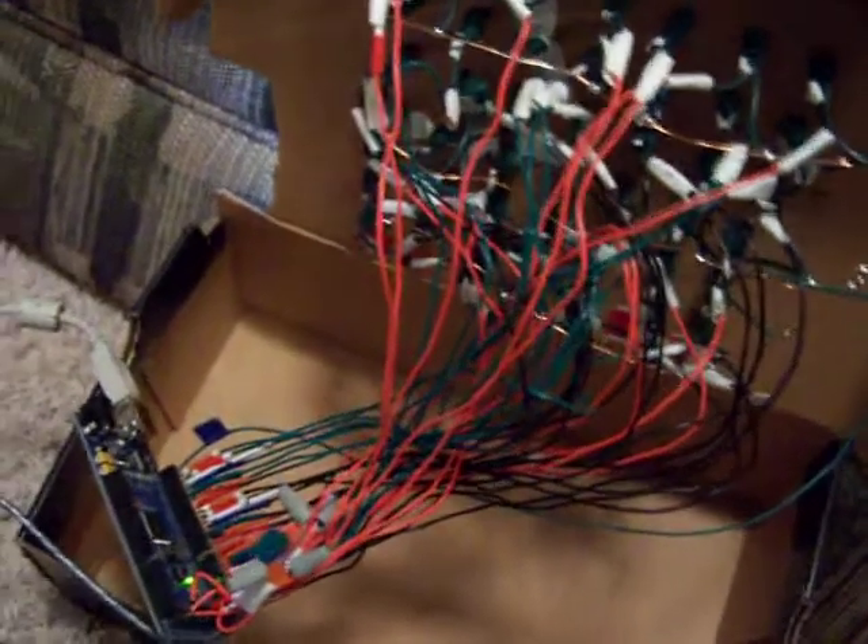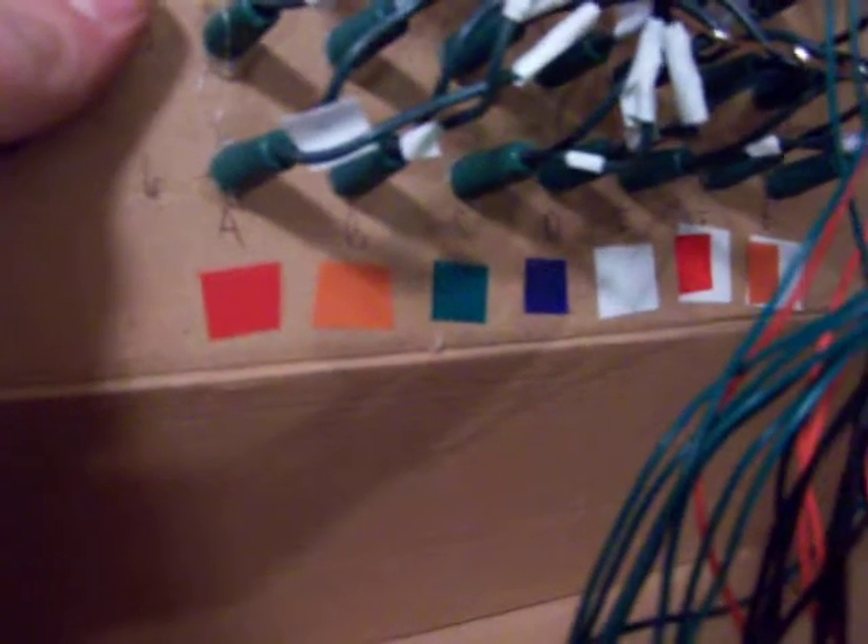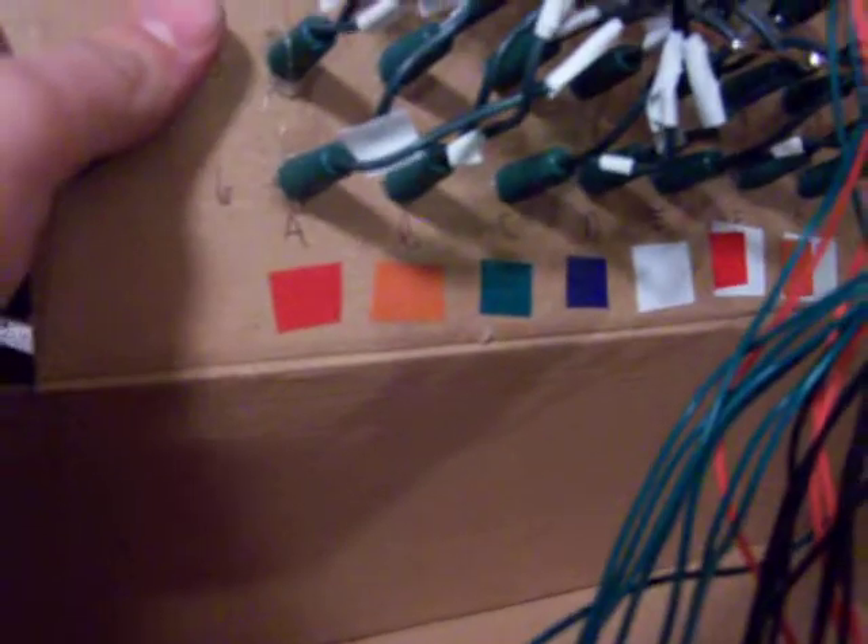Let's take a look at the wiring. This was the most time-consuming part, because each of these LEDs has its own wire running to its own I/O port. I'm color blind, which makes this even worse, so I had to pick a few colors I could see well enough to work with. I also have colored electrical tape to denote the different rows. This is the Arduino Mega — an awesome little board if you have the cash for it.